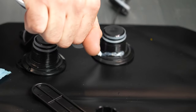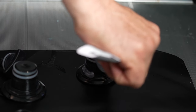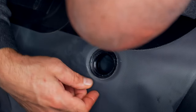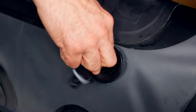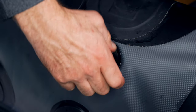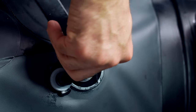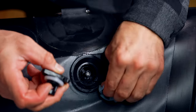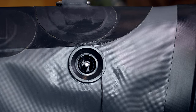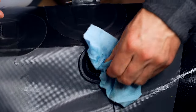One thing you can do is clean up these edges — there's a small bead around the bottom of these threads. You can do this by yourself. I'm going to line this up and center it as best as possible, then grab my new valve. I like to use the string to assist with installation. After I've tightened that up in there, I'm going to clean up any excess silicone. We can let this silicone set overnight, or we can fill it up — in this case, we're going to fill it up and recheck for a leak.